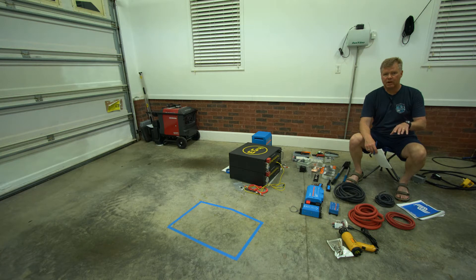That's worked fine when we've been boondocking. If we're going hiking and gone all day, that gives us plenty of time because we're not running many appliances, lights are off, everything. But in the wintertime we're running the heater at night, we have lights on because there's less light, and we're in a shaded area with less sun to recharge the batteries. We start running to the edge of capacity after two, two and a half days, so we just wanted more room.